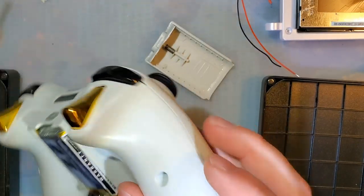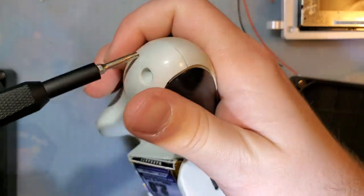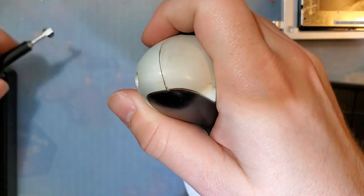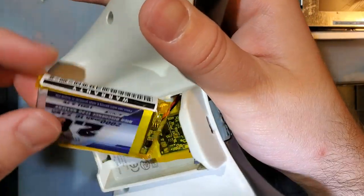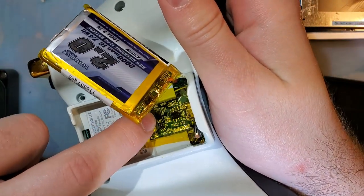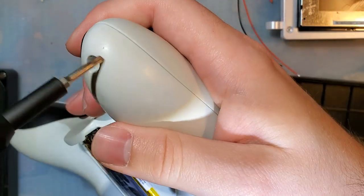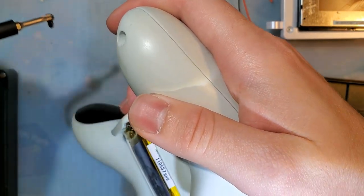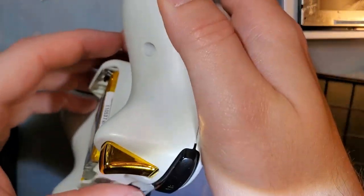But for those wondering how I did this internal mod here, all it is is just a 3.7 volt lithium-ion battery wired into the board. I didn't use the rechargeable battery connectors. In fact, I removed that entirely to make more room. I just used the alkaline connectors, and I did install a diode to drop the voltage a little bit. So if you're familiar with my channel and you've seen me do Game Boy Advance mods, it's the exact same thing.